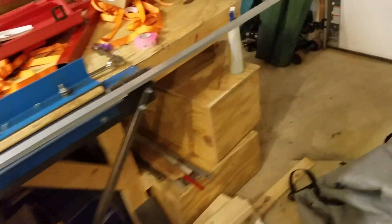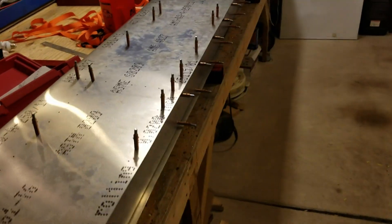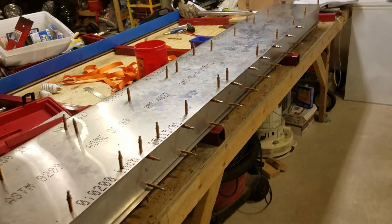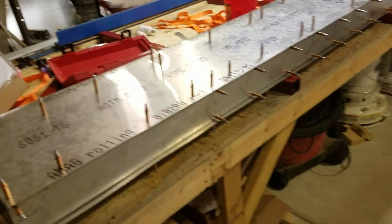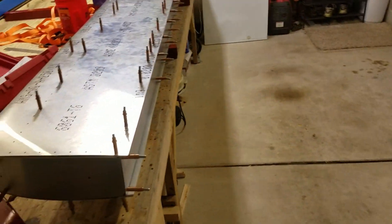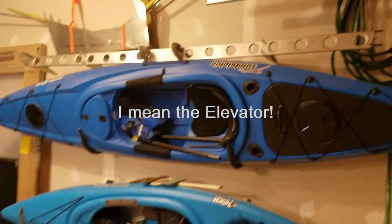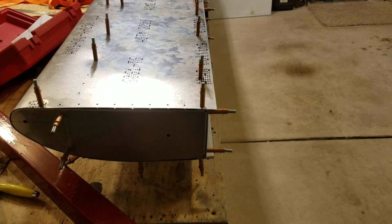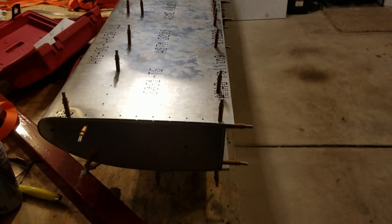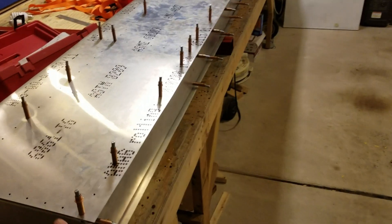Quick update on the rest of the project: I'm nearing completion on the tail section. The horizontal stabilizer is almost done — I've just got to cut the holes and ports for the mounting brackets and then match drill them. The elevator skeleton is already match drilled and Cleco'd together along with the hinge pins. I'm going to try to finish these two structures and get them deburred, primed, and riveted together fairly shortly. I've got a ton of video to cut together for the assembly and construction procedures, as well as for the horizontal stabilizer, and I still have some footage left to shoot.